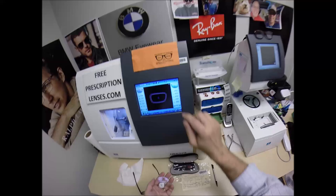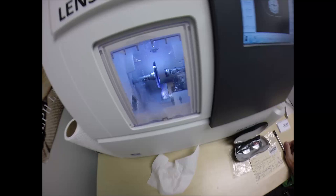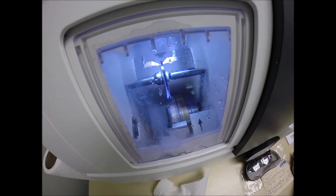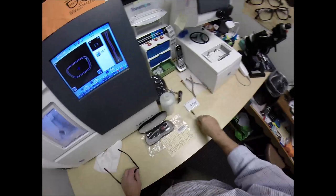Let's go ahead and do the left lens. We're going to flip that over to L. Press that on there firmly into the Chuck — the Charles, the Chucky Baby, or tonight I like to call it the Cody. Hit start. Just like before, the door closes, the clamp shuts. The lens is going to be traced — the old carpenter saying: measure twice, cut once. It's measuring the thickness of the lens at every point, giving me a little book report. I'm going to do this using the front base curve.